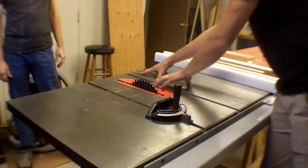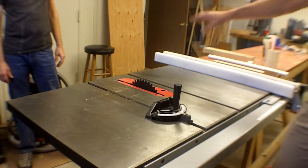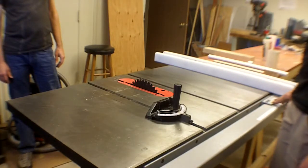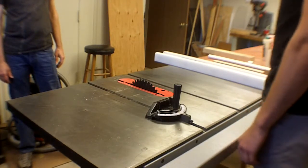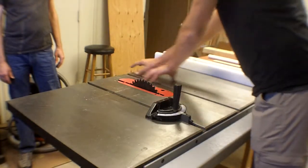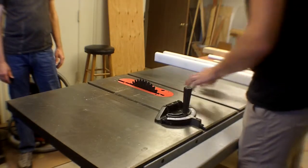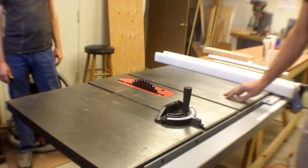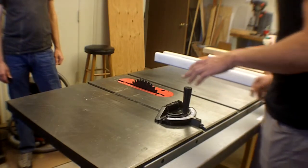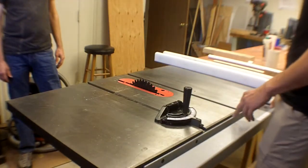With a big piece of material, once the cut is done you have several feet hanging out over open space, which wants to make the piece rotate up — hard to control. The bigger the piece you're cutting, the more likely you are to be leaning way over, which puts you out of your most controlled position. Leaning over the blade is a bad idea, especially since sawdust on concrete makes it very slippery.